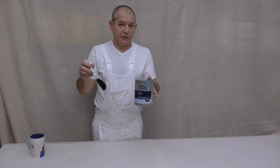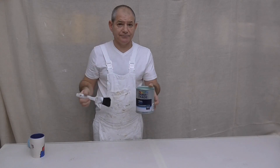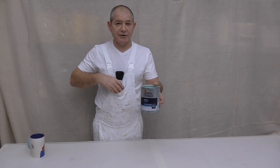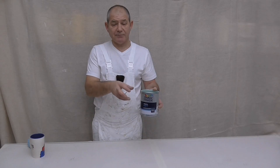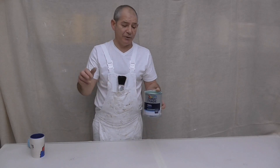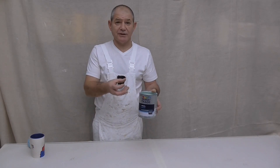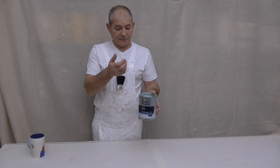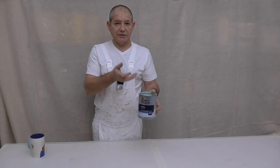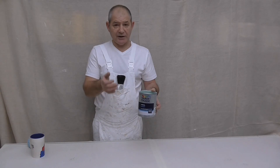There are five main reasons why you don't work out of the paint can. First, contamination — once any bits get into the can, it's all over your finish and it'll ruin it. Second, evaporation and viscosity — the paint is constantly evaporating, it'll thicken up, get harder to use, and you'll have to thin it.